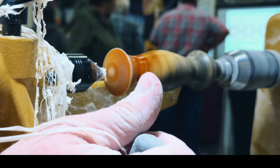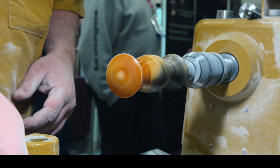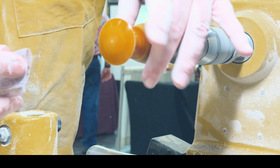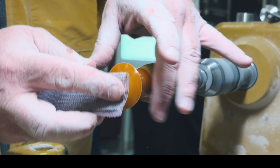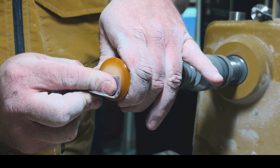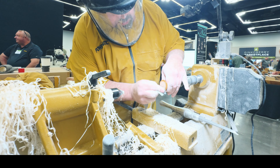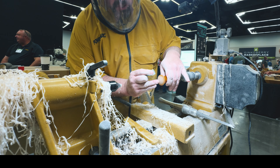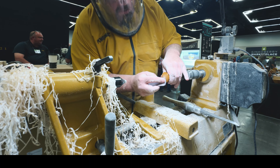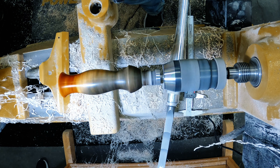Now we're going to slide the tail stock back some. Always remove our tool rest when we sand, and we're just going to buff that little end up a little bit. During this I want to make sure — since I'm putting pressure this way and the only thing I'm holding onto is right there — I'm using my finger for just a little bit of support. Make sure since we're sanding the dead center we're moving around, not just staying in one spot, otherwise we'll start to contort the shape we've worked so hard to get. A little bit of 400, a little bit of 600, steel wool — and now we're going to come in with the Yorkshire Grit.